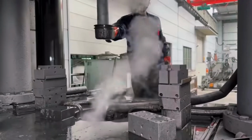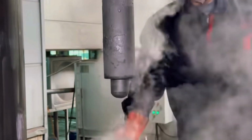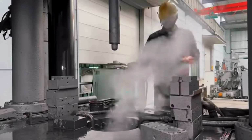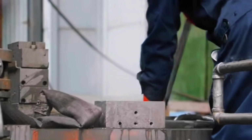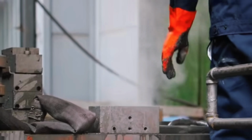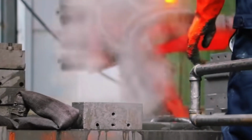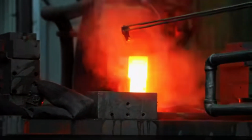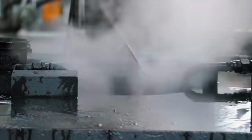Once the axle is stabilized, one of the most critical stages begins: machining. The parts pass through a line of high-precision CNC machines, where all the necessary surfaces are turned, milled, and drilled. Here, exact lengths, external and internal diameters, tapered shapes, ring grooves, and contact surfaces are defined. Depending on the design, some axles require machining of splined ends, surfaces with micron tolerances, or even housings for electronic sensors such as ABS.